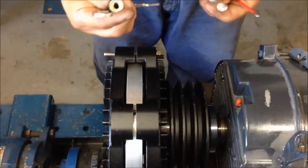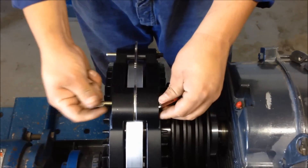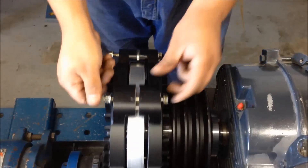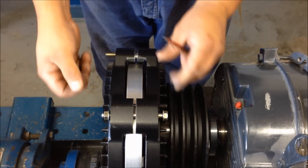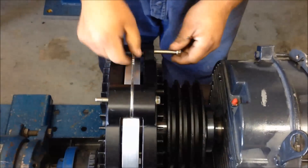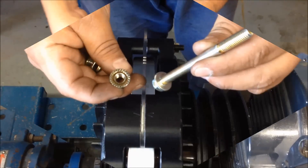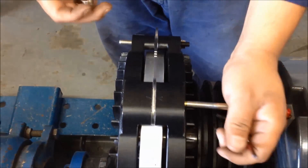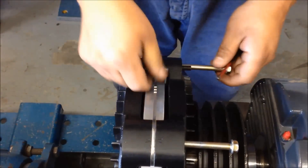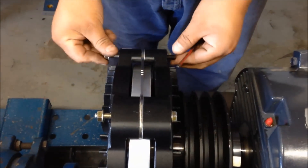This gap should be wide enough to install the desired shim. Remove the retaining bolts one at a time and install the shim. Do not tighten the bolts at this time. Ensure that the three shims being installed are of equal thickness. Refer to the bumps on the outside edge of each shim to determine if each one is correct. The fasteners supplied with this coupling have a unique locking feature — the bolt head has a smooth face while the nut is serrated. It is very important to tighten the bolt while holding the nut stationary, as allowing the nut to turn while tightening will damage the aluminum rotor.